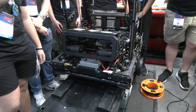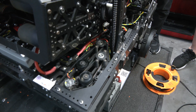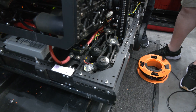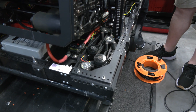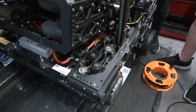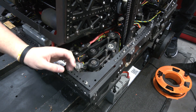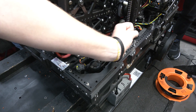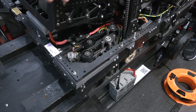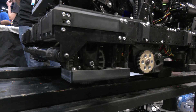We started the season with an L3.75 swerve, but up until week seven of the competition season we decided to change to an L2.5 because we weren't reaching maximum acceleration. We're using West Coast Products Swerve X modules, but instead of the standard triangular motor layout we rotated the module back-to-back to get that extension on the vertical plane of our robot. We did that because we needed the space for our full-width intake.